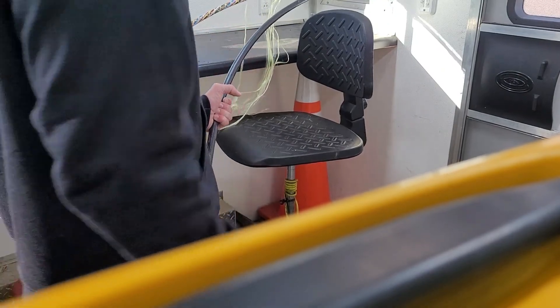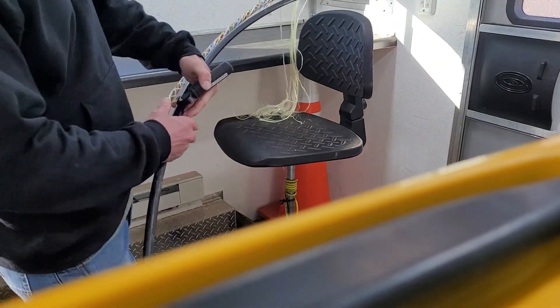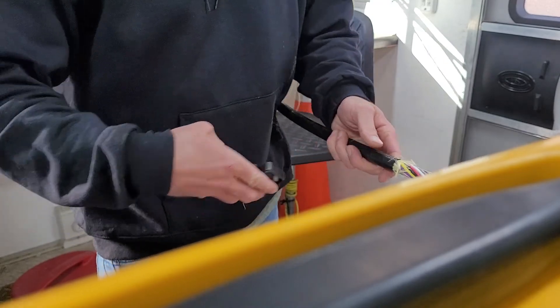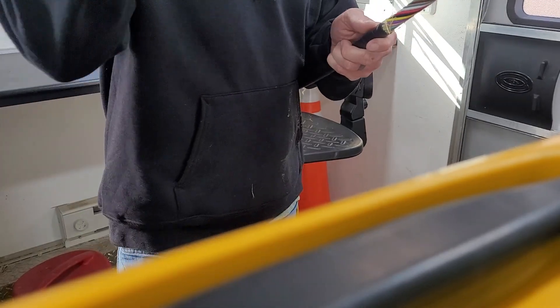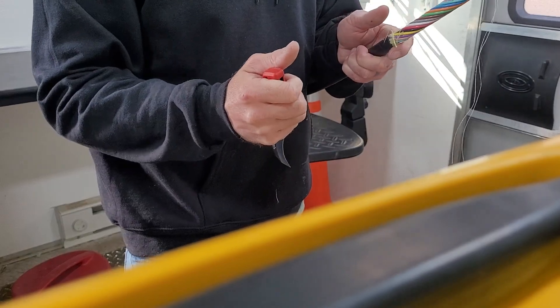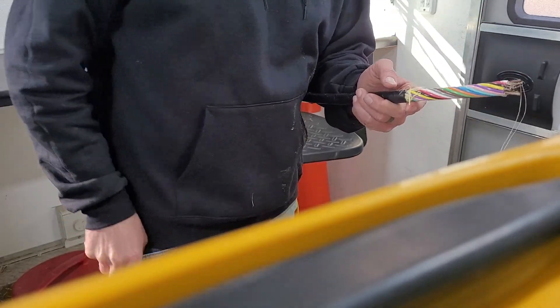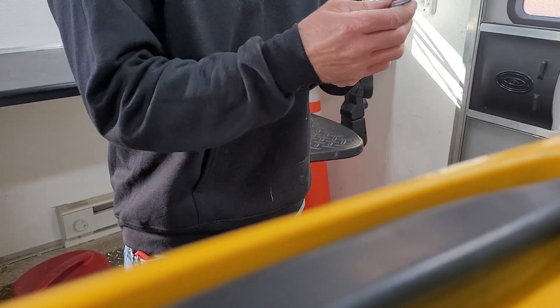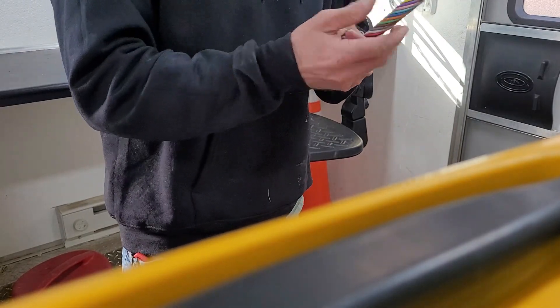Getting back to this — the way I did this tail end is what I wanted to show you. I took this ring cut tool and circled it around right here. This is just my personal way of doing it. I take this little hook knife and slide it up. A lot of times it does not go that smoothly, so sometimes I'll work my way up. It doesn't have to be perfect here because you're just trying to get the cable off — you don't care about cutting fibers or tubes, since this is a discarded portion you're going to throw away.